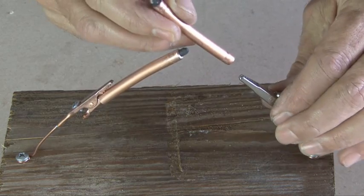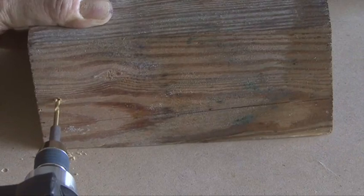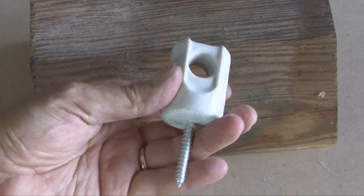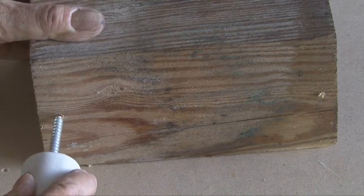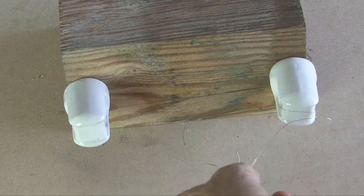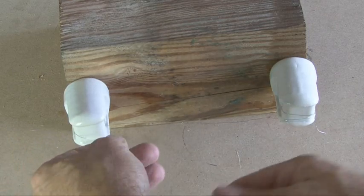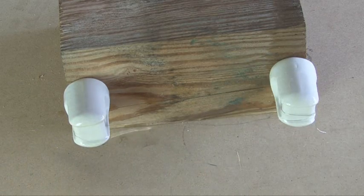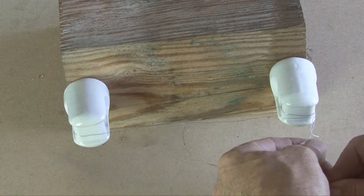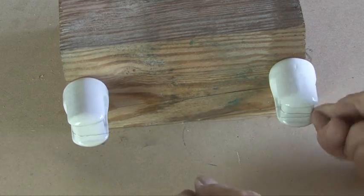Then I attached the copper electrode holders to the alligator clips. I took a drill bit that was slightly smaller than the threads on the porcelain insulators, drilled two holes in the front of the block of wood, and installed the insulators. The purpose of the nichrome wire is to provide some resistance to prevent our 12-volt battery charger from shorting out, so we'll run a couple of strands of that across our porcelain insulators. Your length may vary depending on whether you're using a 12-volt battery charger or an 18-volt battery, and be careful because that wire gets very hot when we run it.